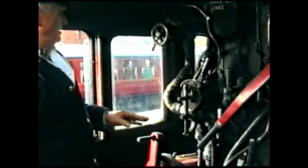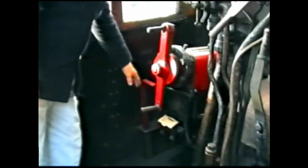Moving across again, we come to the drain cock lever on the left-hand side. This opens passages in the steam chest and the cylinder in the valve chest to allow the condensate that has formed overnight to be blown out of either side of the front of the engine through the drain cocks, to ensure that we have dry steam at all times in these areas. The operation is simply to allow, when we start the locomotive in the morning, the steam to blow through the drain cocks for possibly a third of a mile, and then we would push the lever forward and the drain cocks would be closed. If we were stopping at the station for a particularly prolonged period of time, we would open the cocks, and as we started off for maybe one or two seconds let the steam blow through, then immediately close the drain cocks.